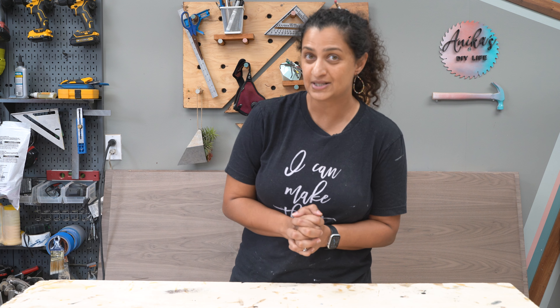I applied two coats of primer. I am using a shellac-based primer because I don't want any of the remaining stain to seep through later. Once that was dried, I poured my white pigmented epoxy. I will have a very detailed video tutorial of exactly how I did this soon, so stay tuned for that. I essentially came back and added streaks of black pigmented epoxy, feathered it in, and played around with it until I was satisfied with the pattern. Once that had cured for a couple of days, I came back with another coat of clear epoxy.